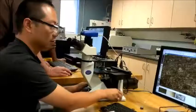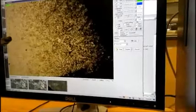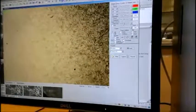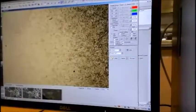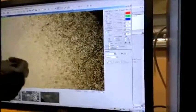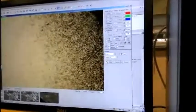We use a microscope to check the microstructure. The grain structure at the outer edge is much smaller than inside. The grain boundary on the edge is clearer than the inside, where the grain boundary is diffusing. From the microscope, we can see martensite — the needle shapes are martensite. The grain sizes are getting larger toward the inside, making the boundary harder to see, and martensite is still present. This means the outer edge is harder than the inside, as the outer edge cooled faster. There is no ferrite — it is all martensite. We save the picture.